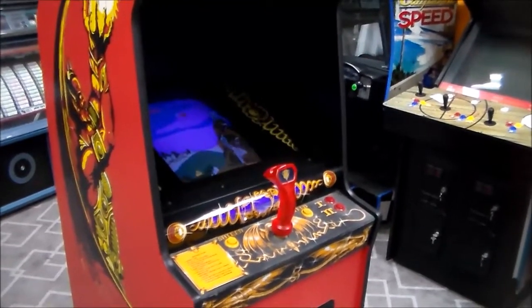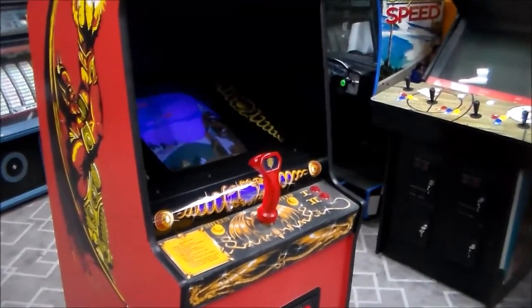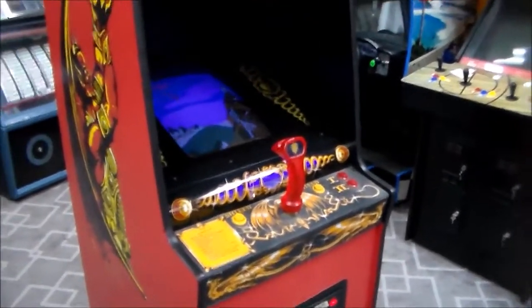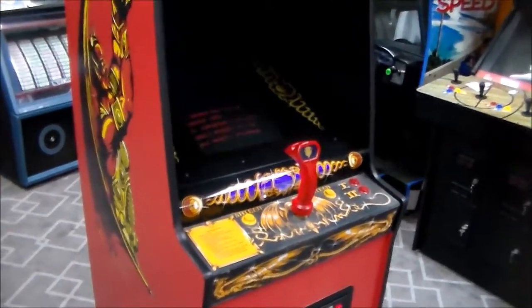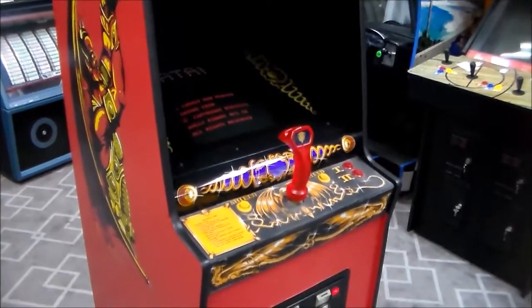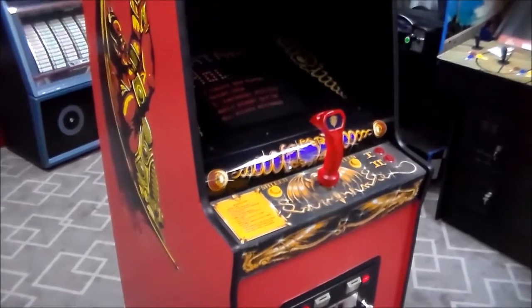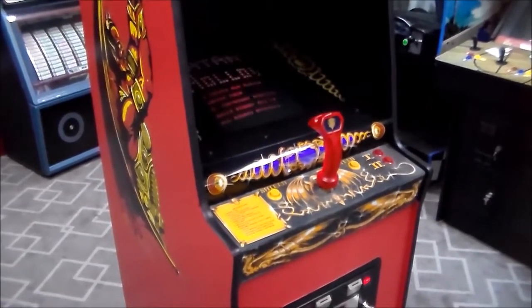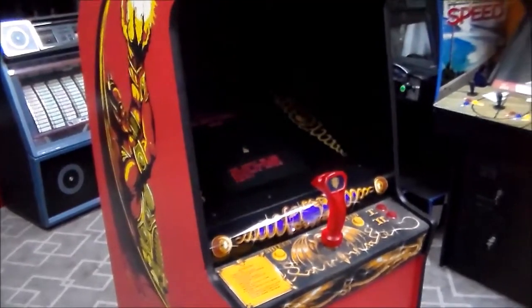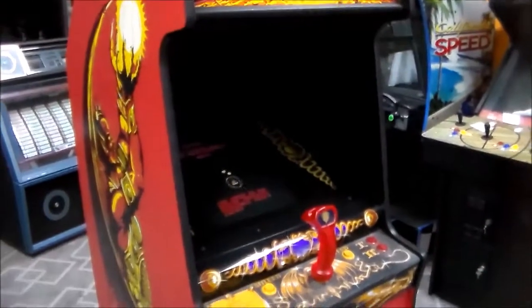And the power supply on the bottom of it is a suitcase power supply, they call it, for these MCR games. And it has these big capacitors in it, these huge capacitors. I mean, they look like Coke cans, basically. One of them is 56,000 UF, and one of them is 100,000 UF. Or I think it's 55,000 UF and 100,000 UF. And those are filter capacitors that filter the signal going to the monitor.